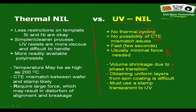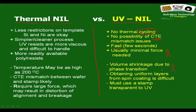There may be issues related to volume shrinkage during phase transition, because UV curing involves a phase transition. Getting uniform layers with spin coating can be difficult at times, though spin coating parameters can be controlled. There are restrictions on the materials you can pattern, and you must have a UV-transparent stamp. For thermal NIL, the limitations are that you need large force and high temperature, making it viscous and difficult to handle.